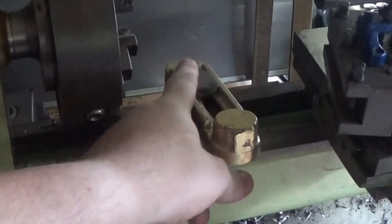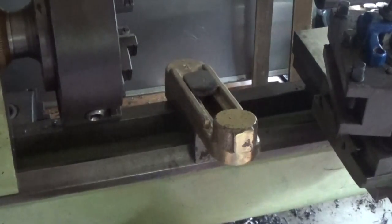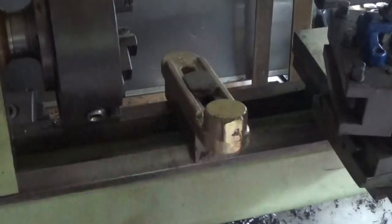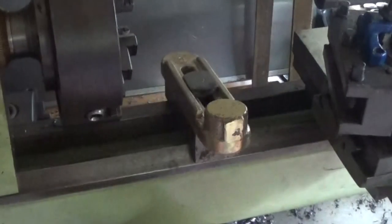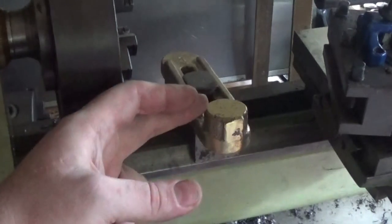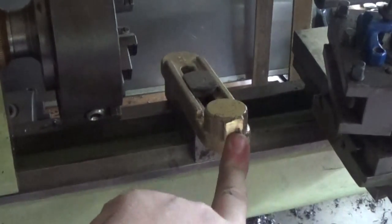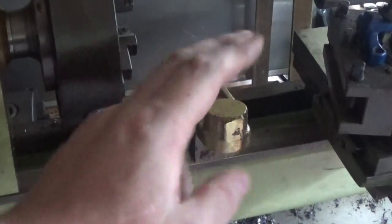This is a trial fit. That slides in there. If we loosen him off, we can move this backwards and forwards like this and round this way. So there's heaps of adjustment. There we go. So it needs to be drilled and a 3/4 reamer through there, and drilled and tapped in here for M6 bolt. And we're starting to look like this part's done.